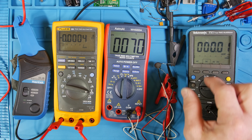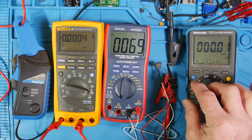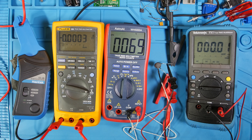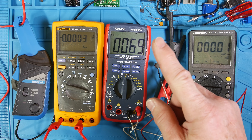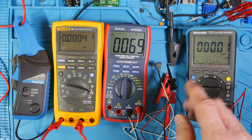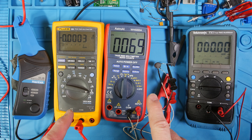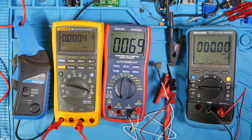It has these leads tied down here — there's some lead length so there's not much cooling. On a circuit board, if you put it closer to the board, the board will help cool it a little bit. But right now in free air with no airflow, we'll see pretty much what we're going to see. On the scope we'll see the current jump up and rise quickly, then increase a little more as the resistance drops until it hits 2.5 amps, and then it'll stay there. I'll also put a voltage probe on the scope — the voltage will go up with the current, but as the resistance drops here the voltage will drop. Make sure that probe is on times 10 — it is. It's also set up times 10 on the scope. I'll set this up to 5 volts per division to make sure I can capture everything. The current probe is set for half an amp per division.